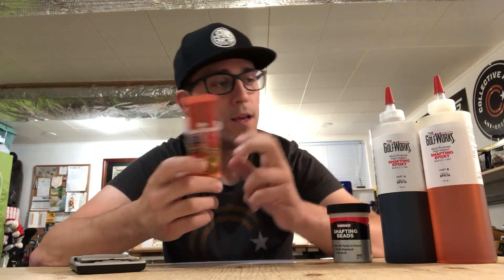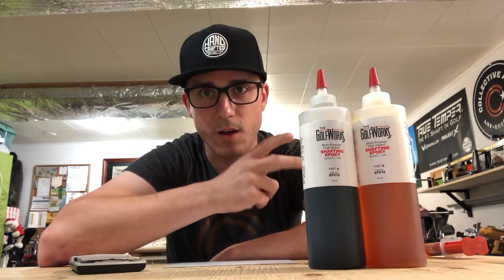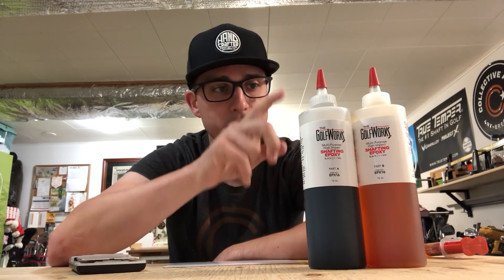This is a two-part epoxy — part A, part B — and there are a couple different things to really consider. This is a longer set epoxy. It's going to give me about an hour of working time and it'll set within 20 hours. You can speed it up a bit if you're using a higher temperature or a heating cell, but I just let things sit and cure on their own. You'll notice the bottles are actually the same size. This is a one-to-one volume mix epoxy, and that means for every one cc of part A you use, you use one cc of part B.